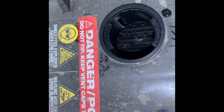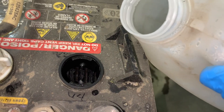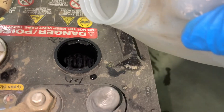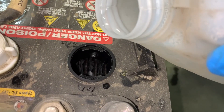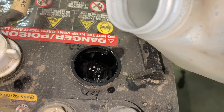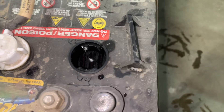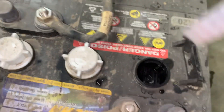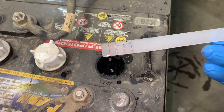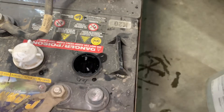Some of these cells are a little deceiving in how much water they'll actually take, so check regularly during this process and don't add too much at a time — just a little trickle. I spilled a little, but since it's just clean water and not splash back, I can simply wipe it up. Checking the level now, I'm already at almost a half inch from very little water added. Check regularly and don't overfill — overfilling leads to overflowing and then you have acid to clean up.